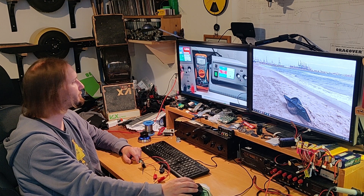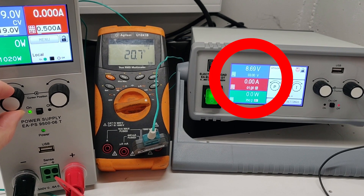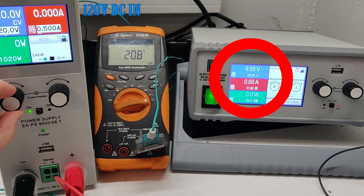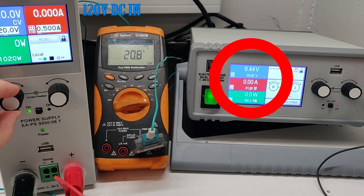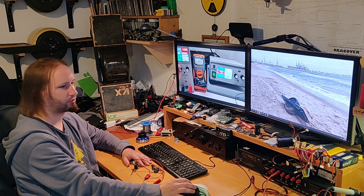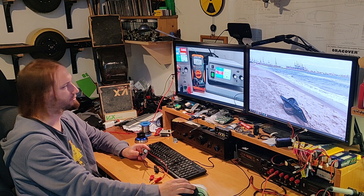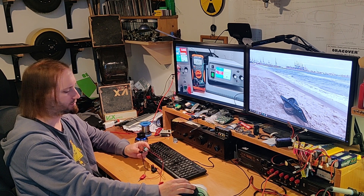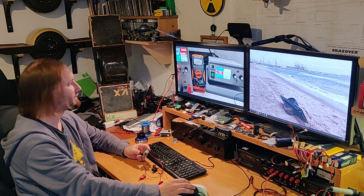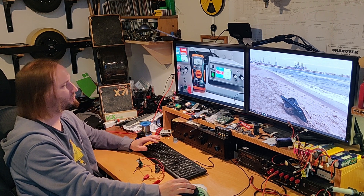Rising the input voltage all the way to 119V, it's already above 8V, stopped at 120V. At this point I would say everything looks okay up to 110V, but above that I don't think this thing works as it should. Either some components are of bad Chinese quality, or the rated specs are not accurate and it doesn't actually handle 120V. But everything is still alive.